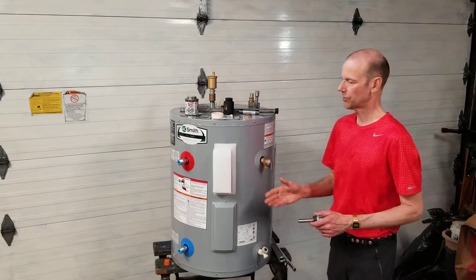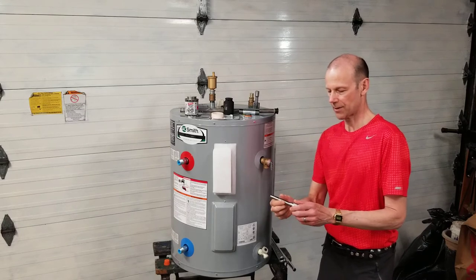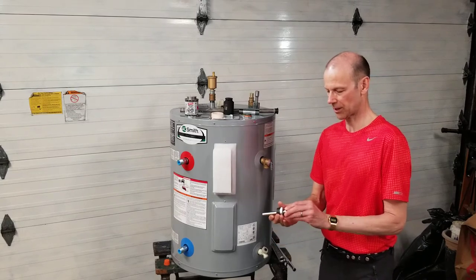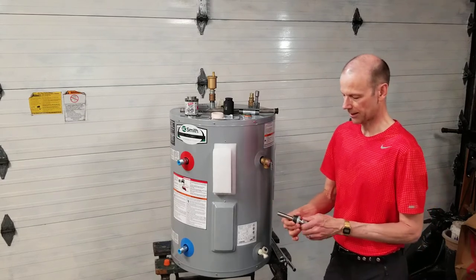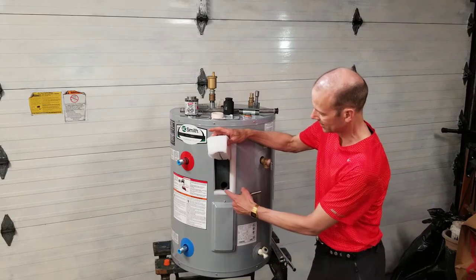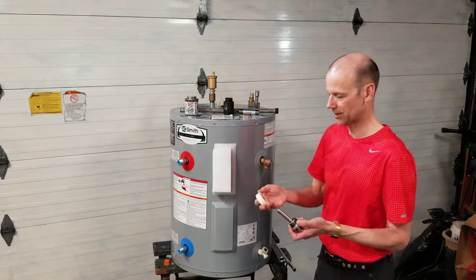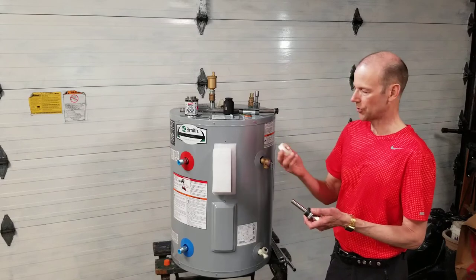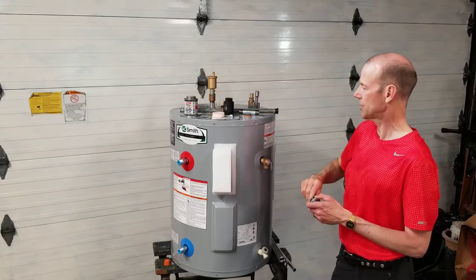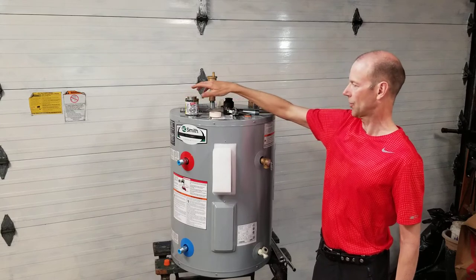The heat pump is controlled by a temperature sensor on or in the tank, housed in a thermal well. The thermal well is a dead-end pipe that threads into a bushing, which has a one-inch tapered thread that threads into the one-inch thread of the electric resistance coil. That's a straight thread, so to get a good seal at only 20 psi, I'm using three or four turns of orange Teflon tape combined with Pro Dope — a combination I've successfully used on old radiators with pitted and worn threads.